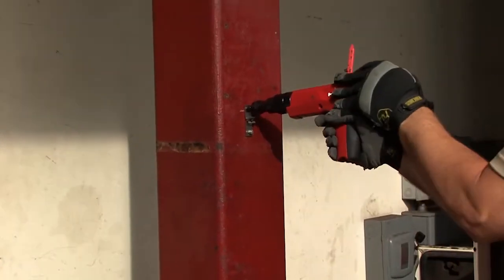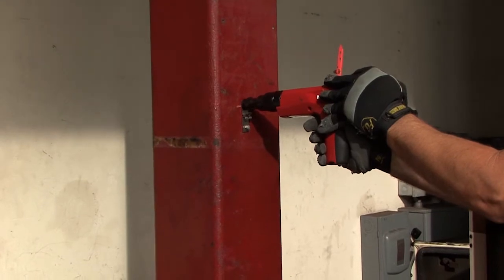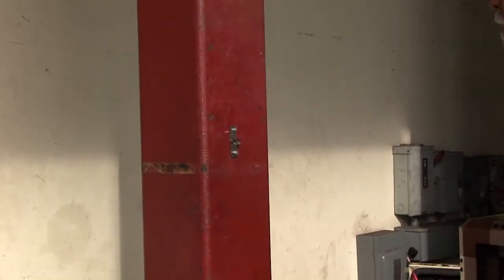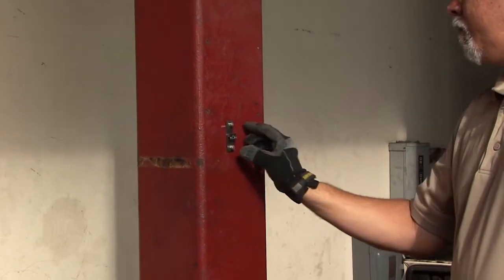When working thick steel net jobs that do not have an exposed lip or I-beam corner, you will need to use a multi-purpose cable bracket with Hilti pin. In order to be certain that the corner attachments do not fail, I suggest installing two cable brackets facing together to form an I. These will be applied by firing a Hilti pin into the steel through the bracket.